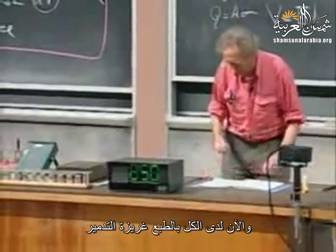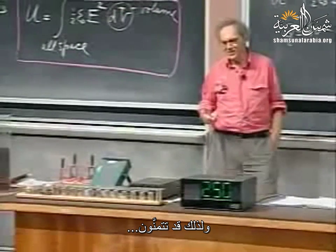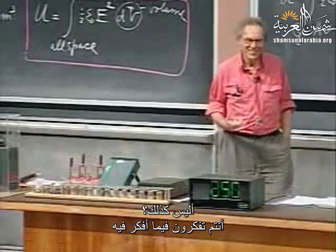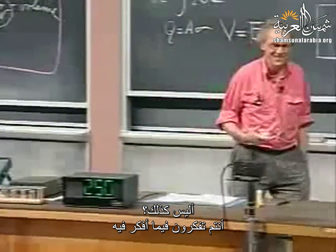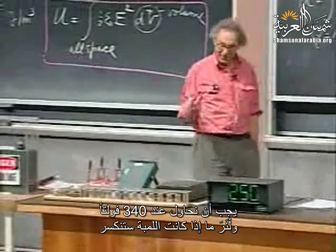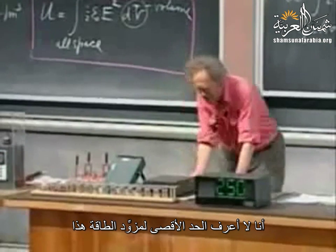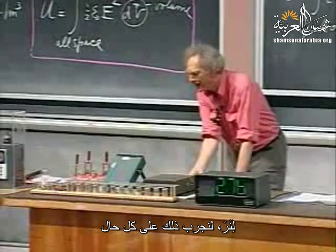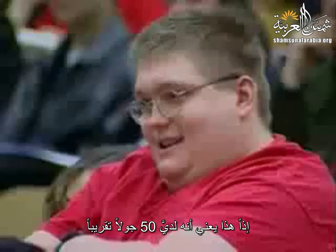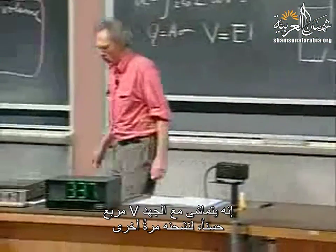Now, we all, of course, have destructive instincts. And so you wonder, right? You're thinking the same thing that I do. Shall we try 340 volts and see whether the bulb maybe explodes? I don't know how high this voltage supply can go. Let's see. Let's go all the way. 337 volts. Okay. So that would mean that we have 50 joules roughly. It goes as the voltage squared.